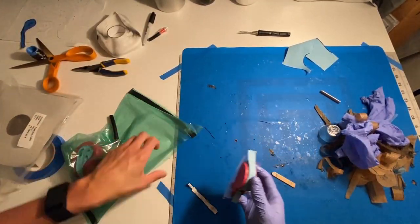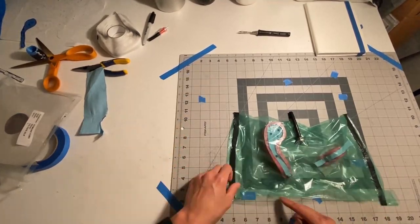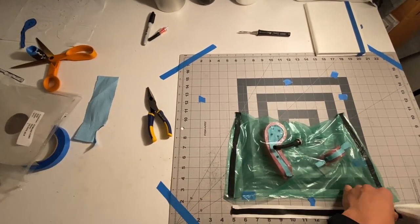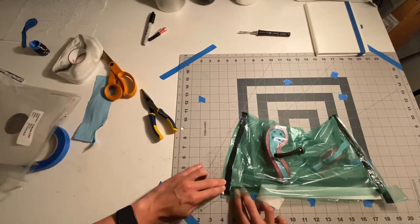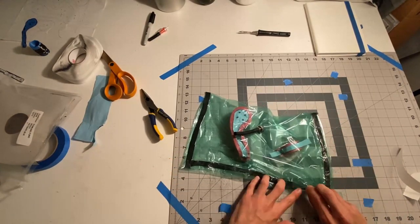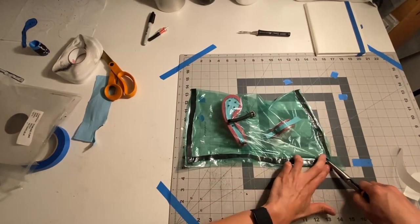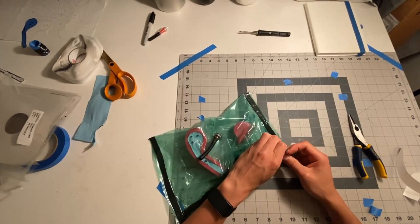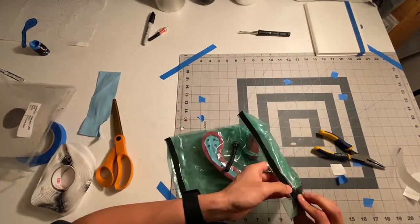After all the layup is done, it is time to bag the part. Vacuum bagging is not hard, but it does take some practice to get it perfectly airtight. I found that smoothly applying the tape is key. Avoid stretching the tape or the bag too much. Stretching and massaging the tape areas afterwards helps eliminate any possible leaks.